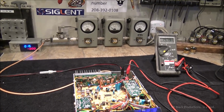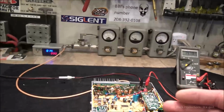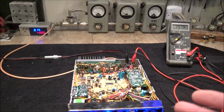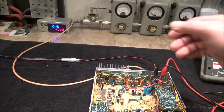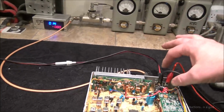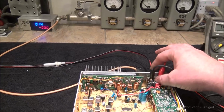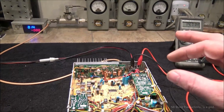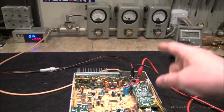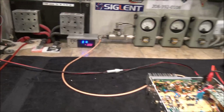But the one thing I learned from this experience is that he had jumper cables going to his 148 radio. And looking back at it now, it's kind of laughable. But what he was trying to point out to me is most of the amperage loss that takes place in your radio really isn't at this connection. Because you can remember electrically, a small piece of wire can carry a large volume of amperage over a very short distance. Okay, so most of our current loss takes place in the power wire. So this is your standard 3-pin power plug garbage.